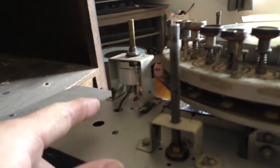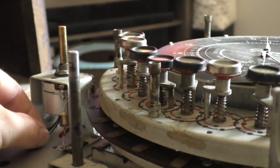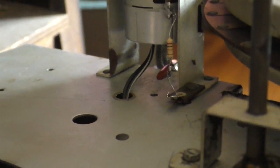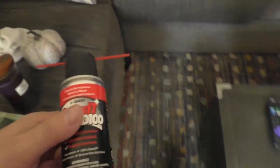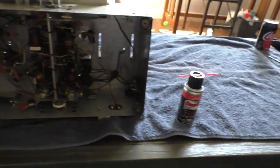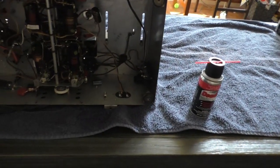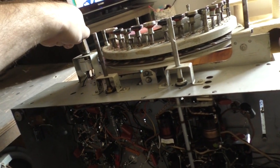I've already taken this power switch apart and replaced the wiring that goes to it because the wiring was in pretty rough shape. I put period-correct vinyl-coated wire in there. It was not good. I took the switch apart and cleaned the contacts with my favorite contact cleaner — Deoxit D100. This stuff has saved me so much in irreplaceable electronic items. My father's stereo, for example — if it wasn't for D100, I would not have been able to salvage it. I used it to save my volume pot because it was crackling really badly.